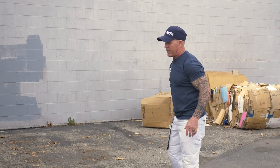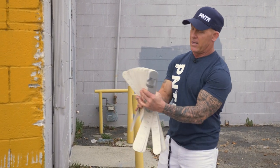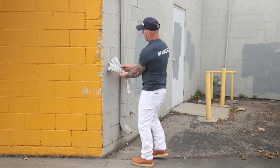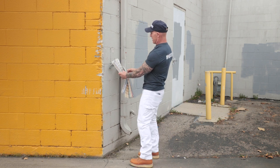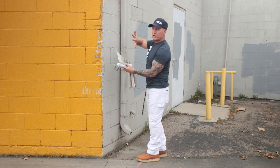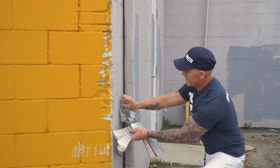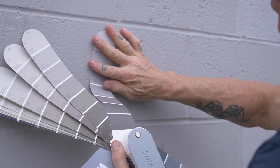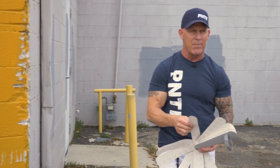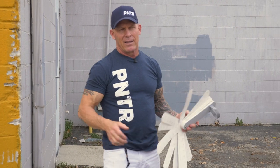Let me show you a color fan deck. Here's a Sherwin-Williams fan deck. If I didn't have a NYX and I just had a fan deck, I'm going to hold this fan deck up against my surface. I see a lot of gray, but I see a lot of red in this gray. I like to take two fingers, cover up my swatch, press the swatch up against the surface, and hold it up there. Proper Gray looks pretty close. Essential Gray almost looks dead on. So the NYX came up with a good match of Essential Gray, and when I verified it with the fan deck, it's good to go.